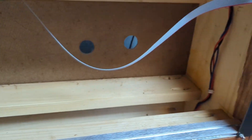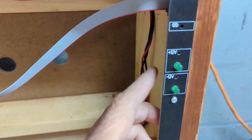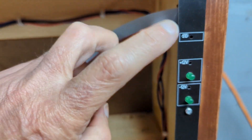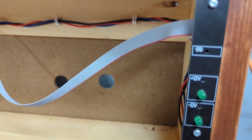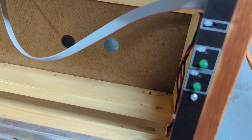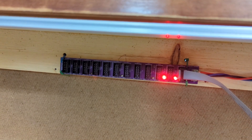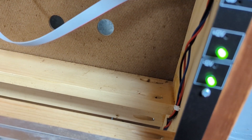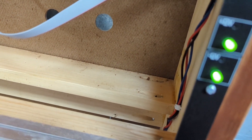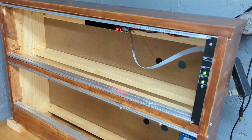The only module we've got here now is a power display. It's got nothing in there but two LEDs, two resistors, and three test points — ground, 12 volts, minus 12 volts. So if we plug in the cable and flip the switch — the LEDs come on, and there are also LEDs on that board there. It powers up, and hopefully this will all work just fine once I start loading up the modules. That's the new Cosmodrome case.